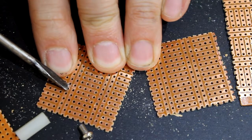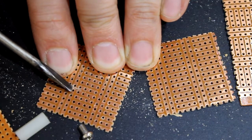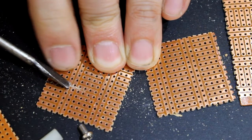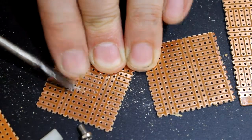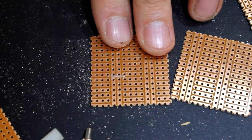it's very easy to slip and stick the business end of the screwdriver into the soft part of your fingers. It's also very easy to slip past the track and into other tracks and maybe accidentally break a track that you didn't intend.